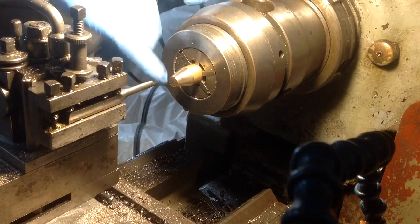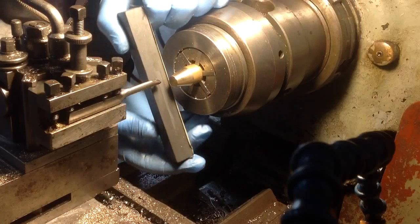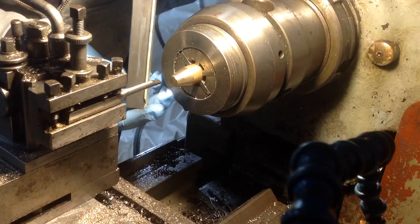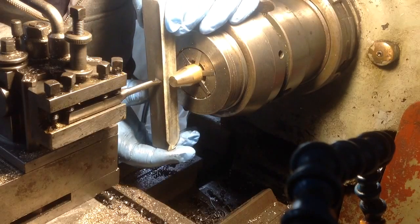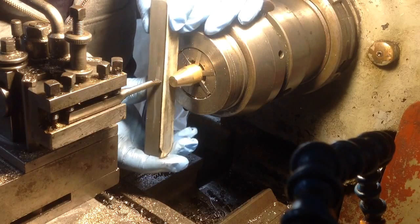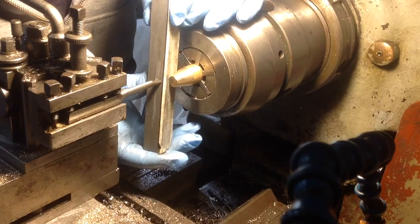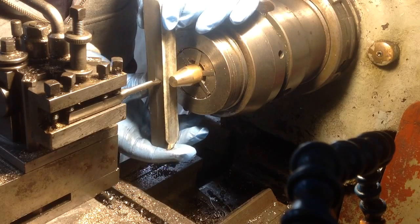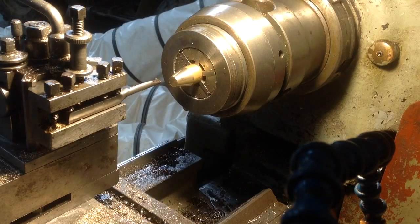And I've got to get it down to 32 thou across the tip. No matter if I go a little bit smaller, because I can hone a smidgen off the tip parallel, and then put my tiny corner radii on. But yeah, it's going to work. I've got to remember to keep plenty of relief on this side because it's a coarse thread. It'll need a bit of angle there, which probably creates an error, but I don't think it's going to be significant. So we'll do that and see how we go.